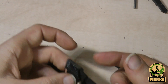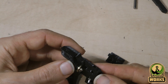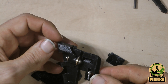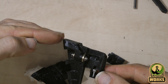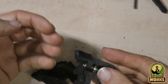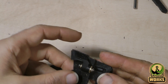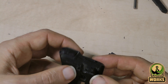Now we will be waiting to get a softer TPU. 95A is not too bad — it feels pretty close to the normal one, and with the 3D printed MAC piece we have seen that it works. But I think if you use a softer one it will just expand a little bit more against the valve and the nozzle, so it will probably work better at lower pressures. We will give that a try, then assemble it and give it another test to see how it works.